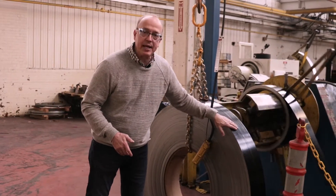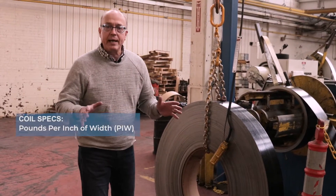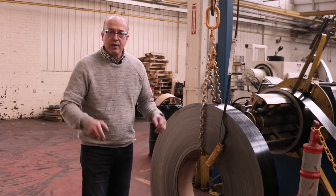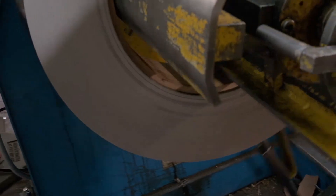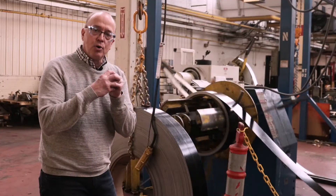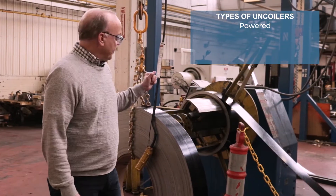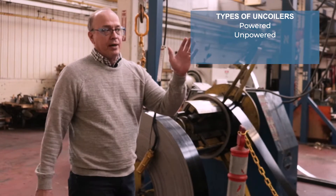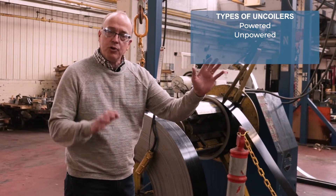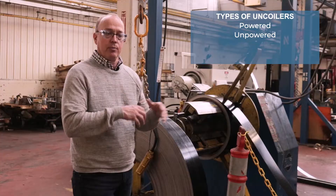This happens to be a pre-painted textured coil today. These coils are specified by a term called PIW — pounds per inch of width. It looks like we're about down to the end of this coil. The coil is retained on there by a center spindle that collapses; when the coil goes on it expands and locks the coil in place. This is a powered uncoiler. There are also unpowered uncoilers that are driven by the pull of the downstream roll forming process — normally used for non-pre-punched parts. When we're pre-punching, as we are in this line, we use a powered uncoiler.